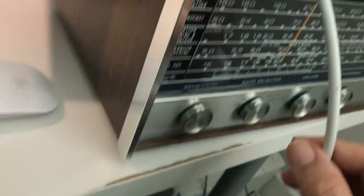And oh yeah, I did put the wire in right where those slugs were, so that when you tune the mixers, you tune this knob here, there are slugs in those coils that go up and down, and that's the best place for sniffing for signals. So I have my sniffing antenna right down here, which is going to this old Zenith radio.